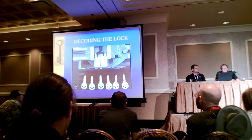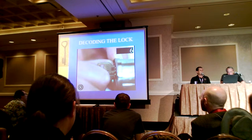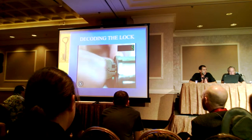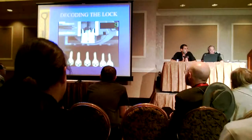So let's start with number six. You just have to put the key in, put a little bit of torque, and try to remove the key. If we cannot remove the key, it's an indication that it's not set for that depth. We go through and probe each of the six sliders, and once we figure out the code, we generate the key for it in like 10 seconds.